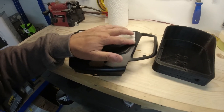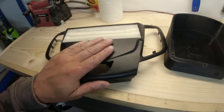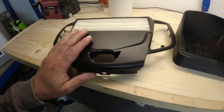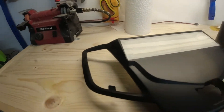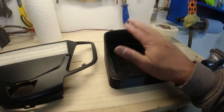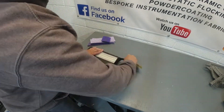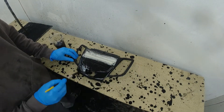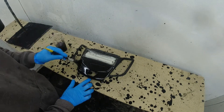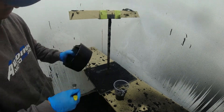I've masked up the front face because I don't want to put any size on the backing plate, which would cause the carbon plate to raise up. I want to leave that as it is. So when I apply the adhesive, I can put it on, smooth it all out, then remove the tape and flock it — leaving the 3D print nice as it is. This other one's not so essential, so I can just go straight on with the flock on that one.